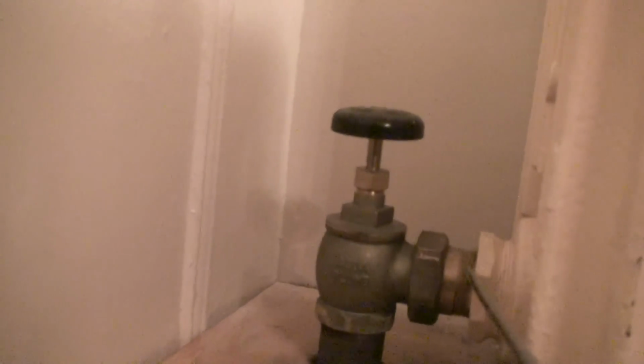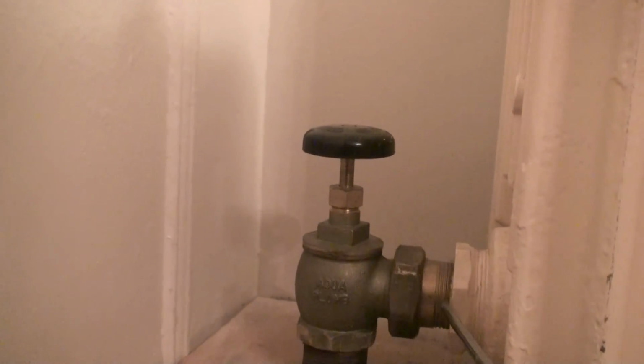The second most effective strategy, and you still get the same results, is you have your main cutoff valve, your inlet up here, and then what you want to do is have your trap down here. The reason why I say this, once again, you have to understand the way steam travels. Steam is only going to take the easiest route out. So whenever you have a situation where you're automatically feeding it from the top, you want to force it to go to places where it would normally have a difficult time to go in.